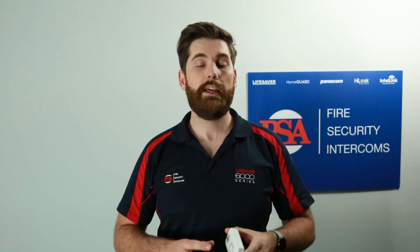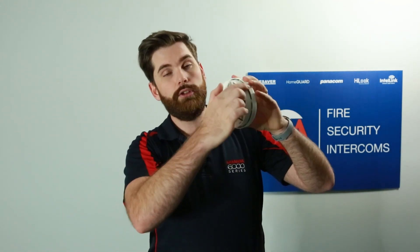Once you've worked out which is the triggering alarm, it'll allow you to rectify the cause of the alarm. This could be either cooking smoke, dust, insects, or a bit of moisture that's in the alarm. The best thing to do is take the alarm down, give it a good tap around its sides to loosen up anything inside, and give it a vacuum around the edges. Ideally you want to be vacuuming around the side where there's usually a gap in the plastic, because that's where anything's going to get inside.